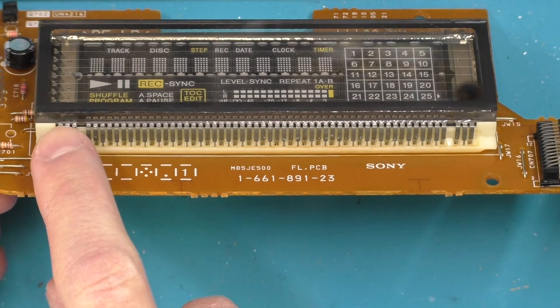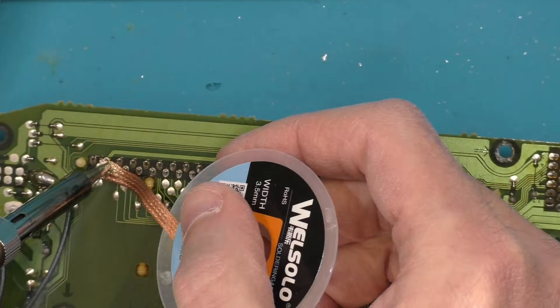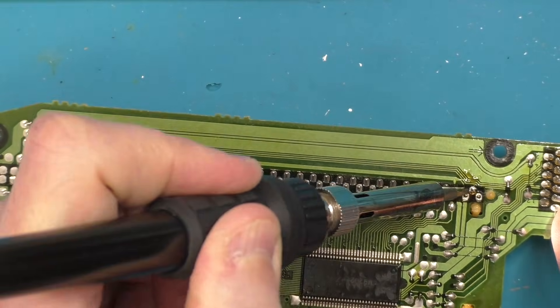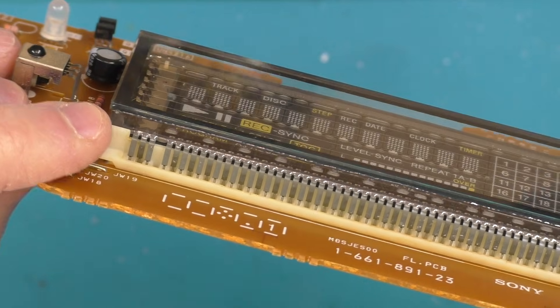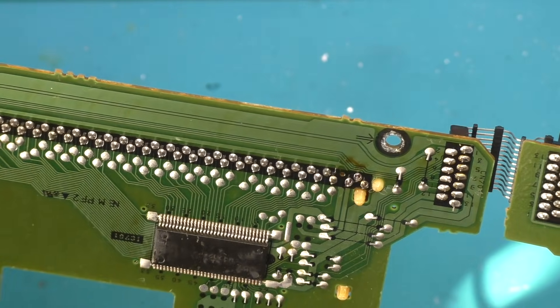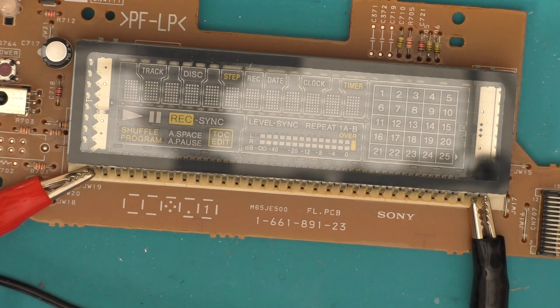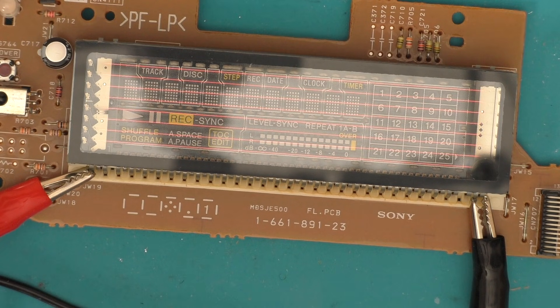The heater wires appear to be the first three pins on either end, so I'll desolder those and inject some voltage. I don't think it's really possible to bend these pins fully off the board, but I'm fairly sure they're no longer making contact with the pads so that's going to have to be good enough. I'm just turning up my supply. You can see the wires glowing — that's nine volts. I'll leave that for a few seconds, drop it down, and do that again twice more.